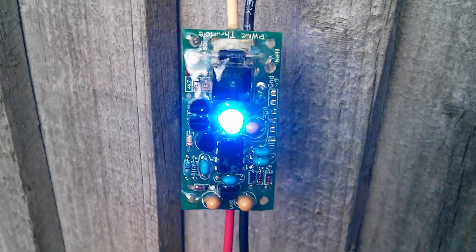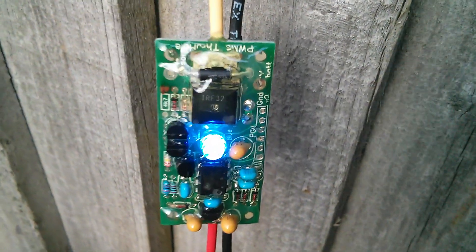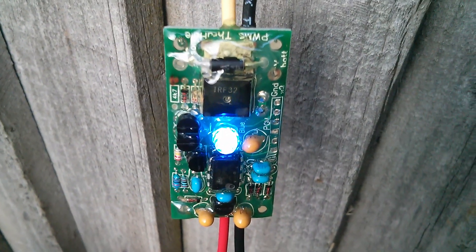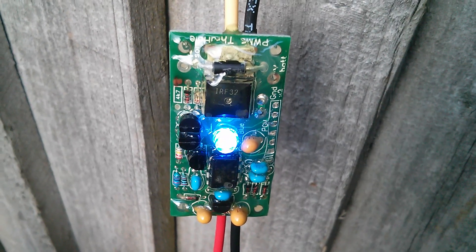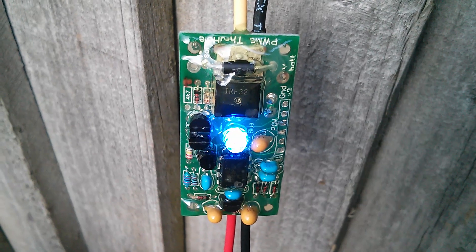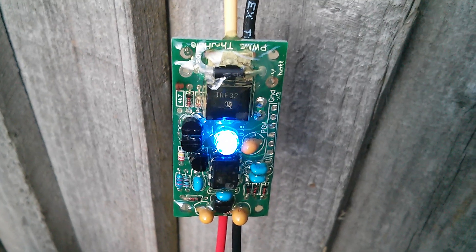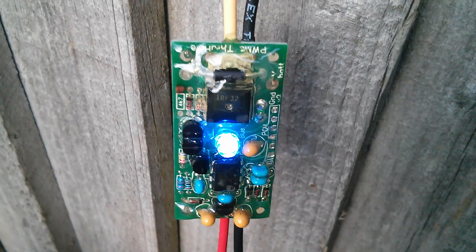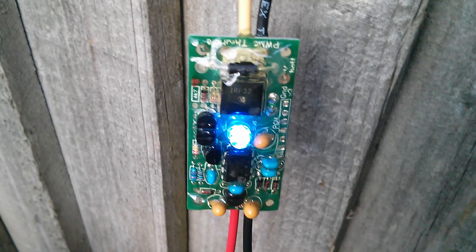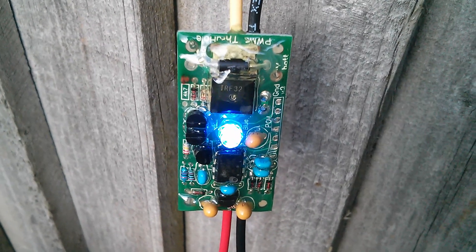You can see there's some corrosion at the top. I suppose I give up trying to use conformal coating as a housing — it's never going to work. I think moisture is creeping in particularly at the top through those yellow and black wires. At the moment it hasn't gone far enough to cause a problem; it's still functioning perfectly.